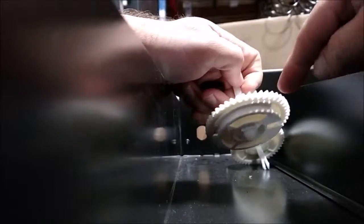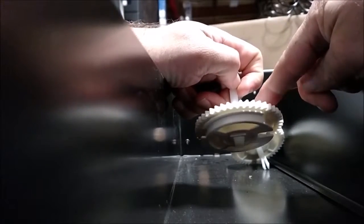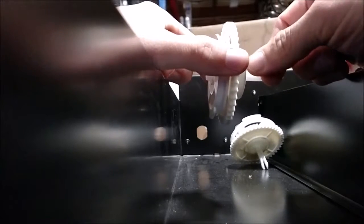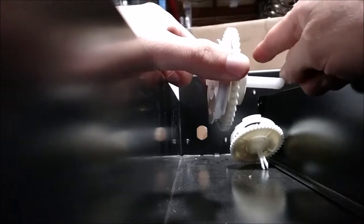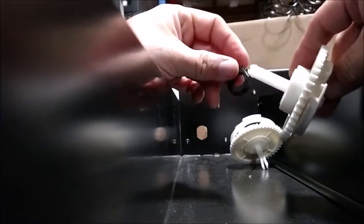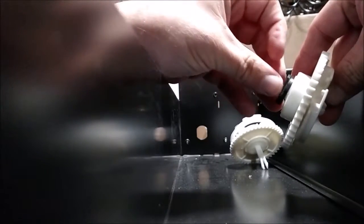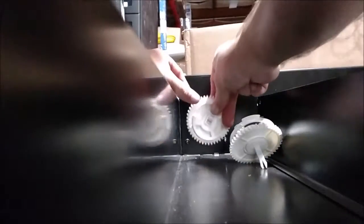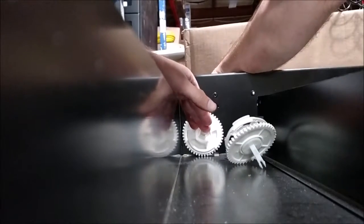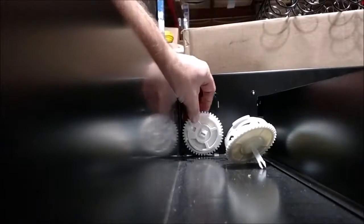It's important to note the orientation of the shoulder. On this first one, we're going to put the shoulder to the rear — so the coil goes this way, the shaft goes through the wall this way, and the shoulder is right here. We'll have this much space between the back wall and the gear. Take the washer with the flat portions faced away, slide it on, and slide this into the hole lining up the flat part, then put the top hat over the back.